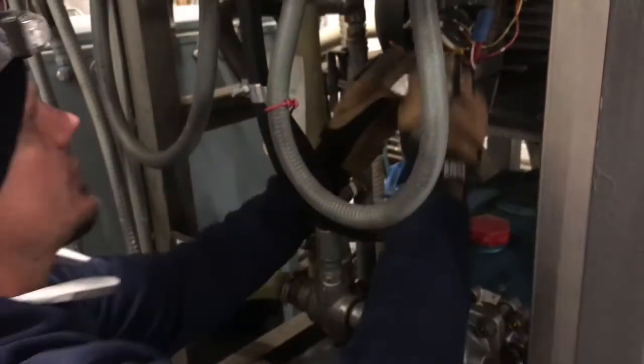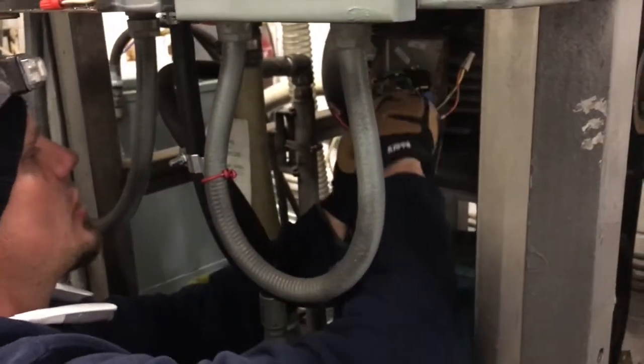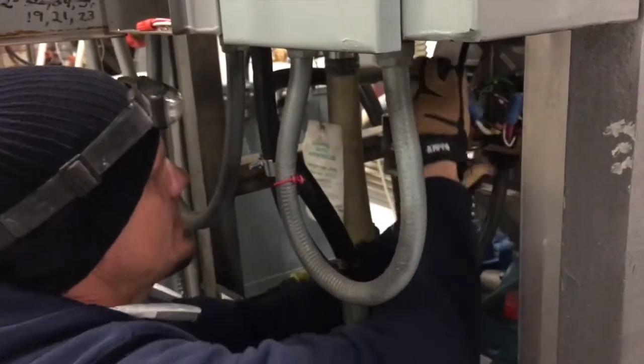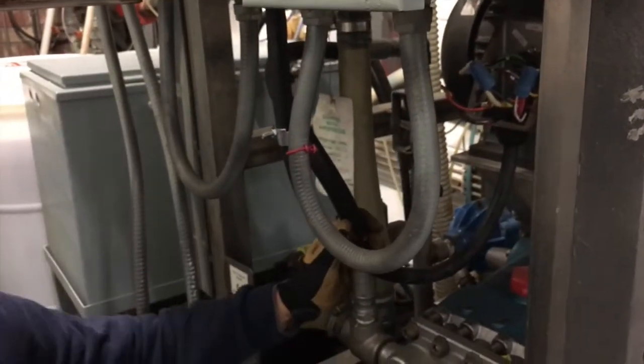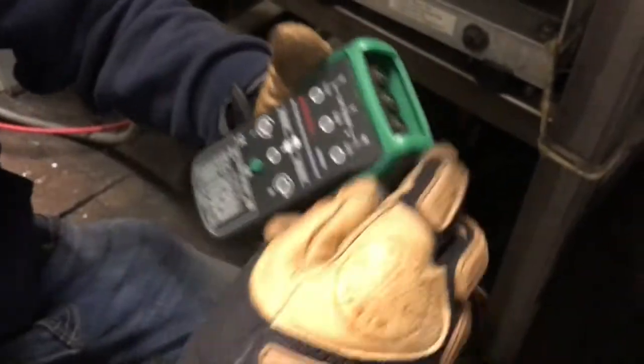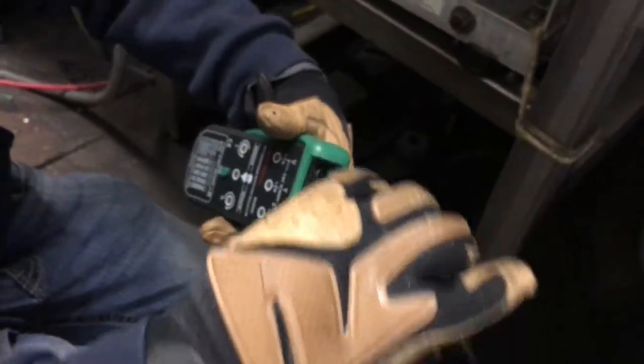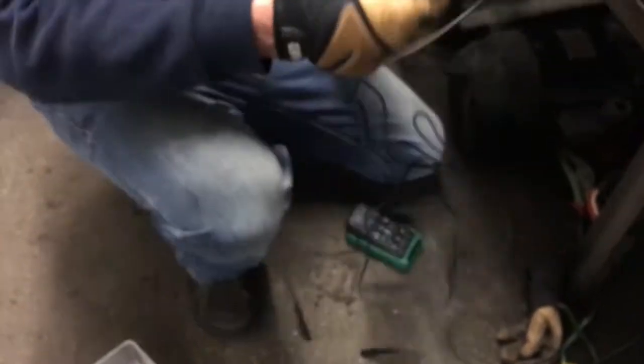And then I did bump start it. There is a trick to the disconnect — I want to show you that. I thought these wire caps were on; I was checking the phase rotation. And you can do that down below here guys. I have a meter that's a phase rotator. The battery just died, so I'm going to do that. But it basically states that there's an L1, L2, and L3, and you're going to line those up correctly. When you have them, you're going to be going L1, L2, L3 left to right, putting it down here on the motor — the motor leads.